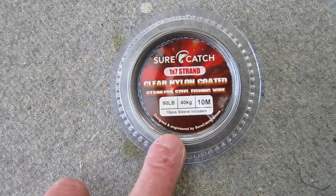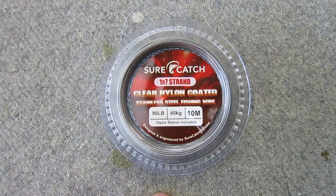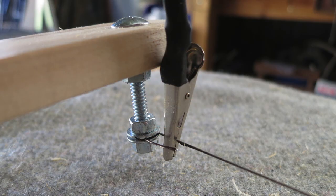So then I moved on to stainless steel wire — this is the only stuff I could find, but it's 7-strand and nylon coated. I needed to burn off some of that nylon to make a good electrical contact, and the rest of the nylon burnt off as it heated up. This is how it attaches to each side via the bolt, and the alligator clip provides power from the power supply.